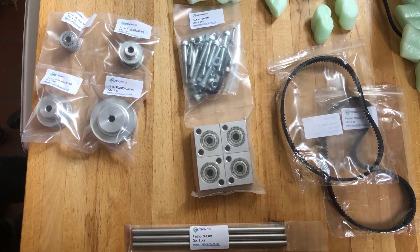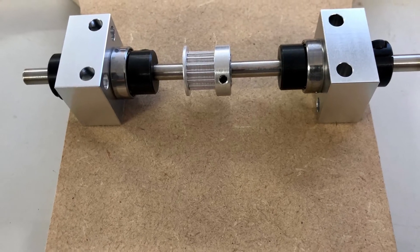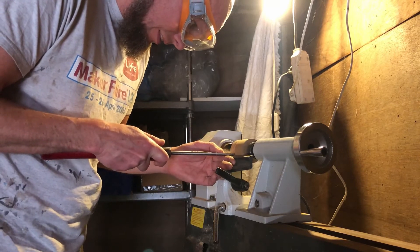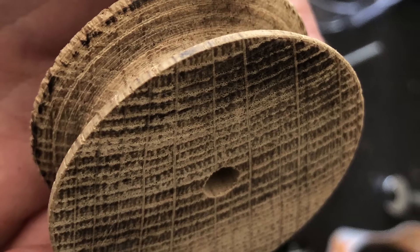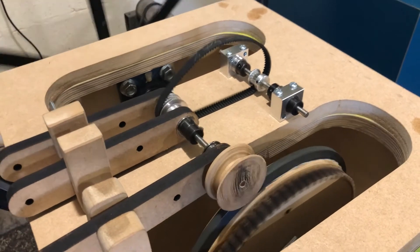One reason is that it meant I could use more engineering grade parts — straight bar instead of threaded bar — and then a better coupling system using belts and stuff like that. It also meant I could gear it. The way it joins the module I also adapted, because we normally use cogs and they chatter quite a lot and make extra noise. I tried to take that away from this module so that it could make more noise in the musical sense than in the just-noise-of-the-machine sense.